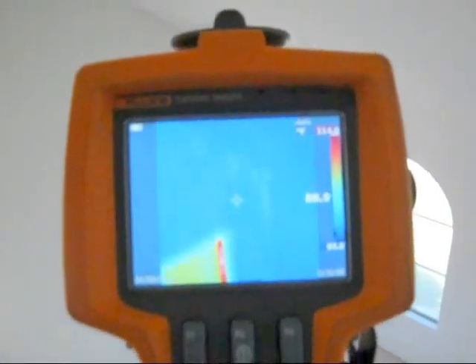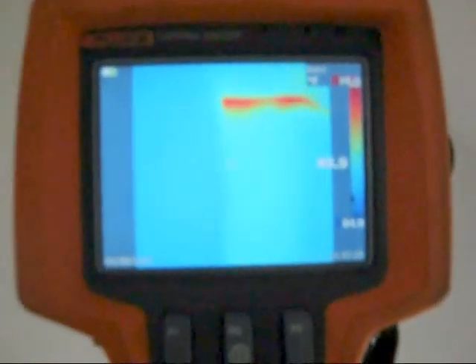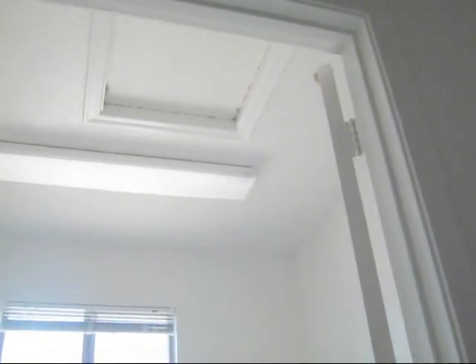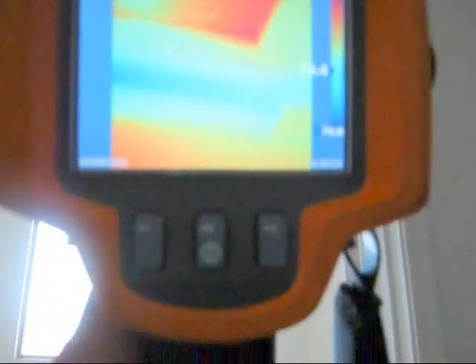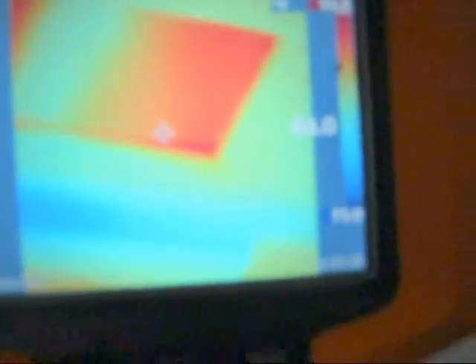We're also looking at the rest of the walls for insulation. Small hot spots — very minor areas of missing insulation — are not worth tearing a wall open for. Sometimes the insulation sags a little bit on the wall. But when we do find large areas, we know there's a potential problem that could be heating up a room. Here we have an access panel that should have insulation over it; a lot of times it gets moved out of place. As we can see here, that is almost 87 degrees, while the rest of the ceiling is around 80 degrees. I've seen these attic covers be as hot as 110 — that's just heat pumping into your room.